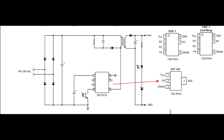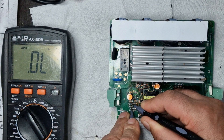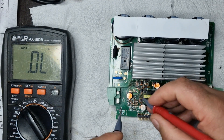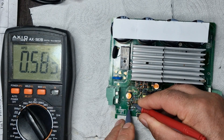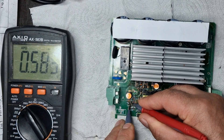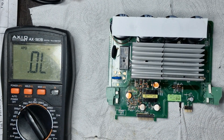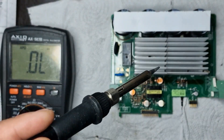After several searches, I found that the NCP1014 is exactly what I need to replace the faulty integrated circuit. The next step is to inspect and measure the other associated components, including the resistors and transistors connected to the faulty integrated circuit, to ensure that everything is functioning correctly. I found the 27-ohm resistor and the transistor in short circuit, both components being part of the feedback circuit.